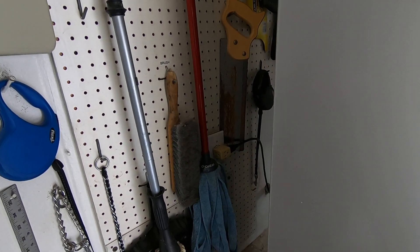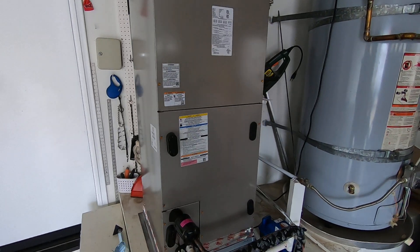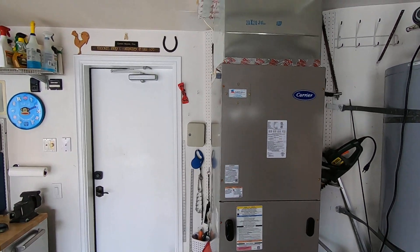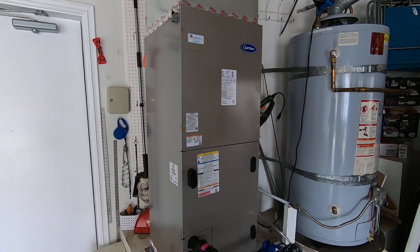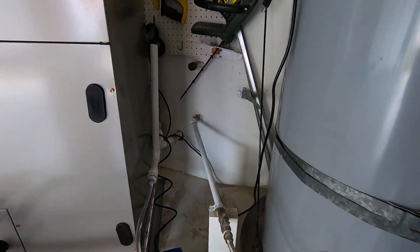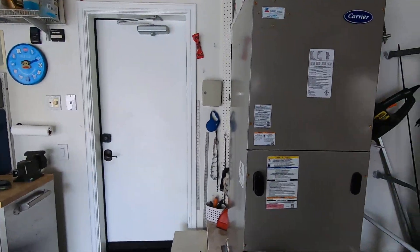We could not use that because it was daisy-chained with other stuff in the house, like plugs, outlets, and lights. So basically this system replaced the gas furnace, so now it's carbon-free — we capped the gas line, which is right here, and that's all capped. The flue vent right there is also capped, and everything is now all-electric.